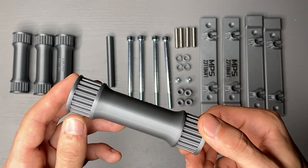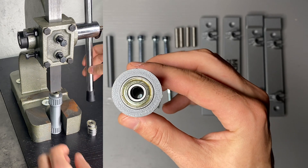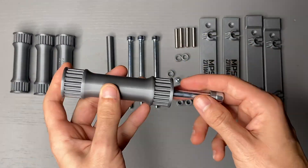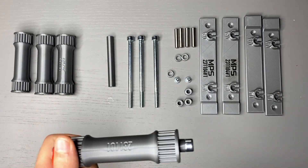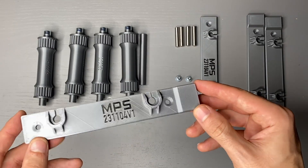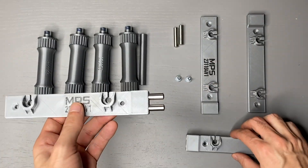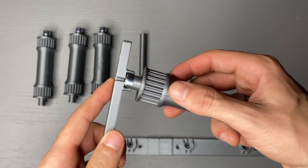This is one of the 34 rollers on which the belt runs. I press-fitted two bearings into it — this bearing size is called 608 and it's one of the cheapest bearings you will ever find. The roller is then completed by a long M8 cap head screw, which snaps into the compliant mounting plates. Inside the part there is a long spacer, which is really important to avoid damaging the bearings when tightening the screw. The mounting plates are two parts joined together using two dowel pins, and the rollers are simply mounted by pushing them into the pockets.